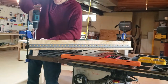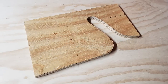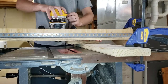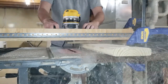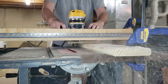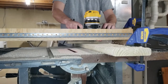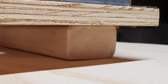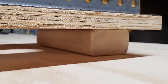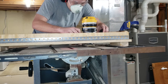I can't really show you the project that I'm working on that caused me to make this sled — it's actually a Christmas present and I don't want to spoil the surprise. That said, here's a scrap piece of wood that we can do some test runs on. I'll stress the importance of being level. I've got this nice old cast iron table saw, and I trust that as being pretty flat, so I opted to use that as my surface of choice. Each pass chops out about a 2 inch section and just planes it down slightly. But it just isn't working right — the sled is too high and I needed to lift up the cut board, making for an uneven surface. I'm going to flip these 2x3s down to get the sled lower and remove the need for these extra lifting boards, and also switch over to a piece of trim to better demonstrate what it's actually doing.